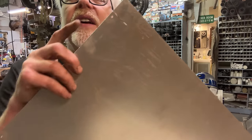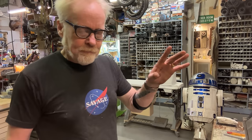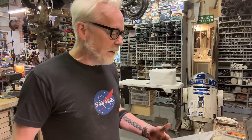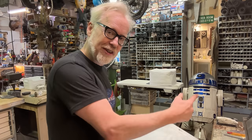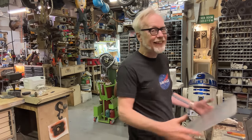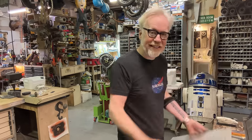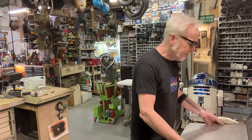I have punched the four holes where the rivets will attach to the shelves. There they are. I'm using a hole punch. If this all works the way I want it to, then I'm going to make a jig for this hole punch so that each of these bends can be made at once. I'll have a stack of 60 of these, and I'll be workshopping through an assembly line-like process. Right now, I want to do the backs first.